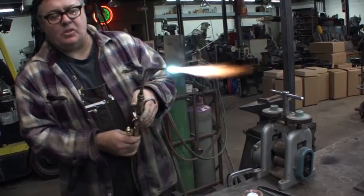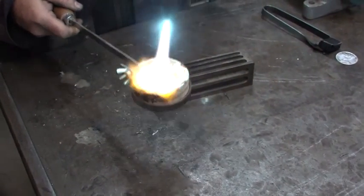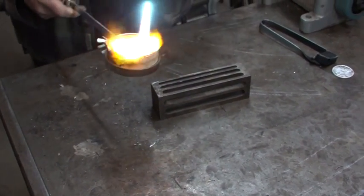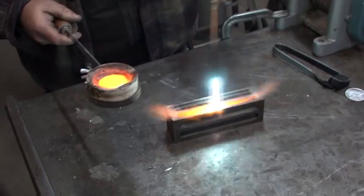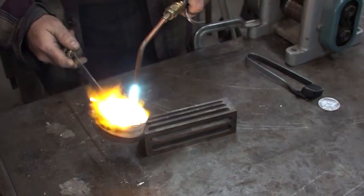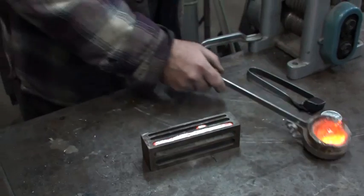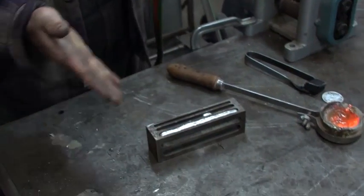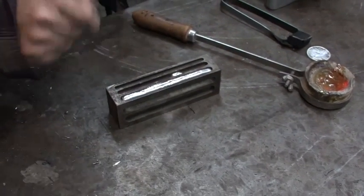That's pretty good — it sounds like the space shuttle. I've got three ounces — kind of neat, huh. Heat the edge of your crucible so you don't get a cold pour; I'm going to pre-warm this a little bit. When you start pouring, don't stop — you want to get a nice continuous bar. It'll get cold spots in it and you'll see them, so when you pour, just fill the whole thing.